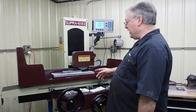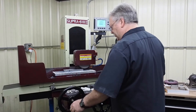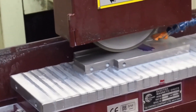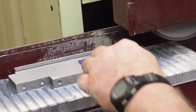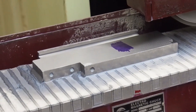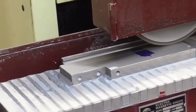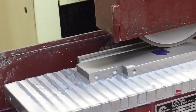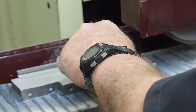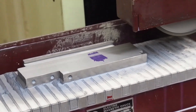I think this will probably be the last pass I do. I think everything's flat on that wheel within one tenth. I'm at the same surface that I cleaned up. I got my ink spot. Looking at that, we got just a little bit on that back end — and if I'm going to have it anywhere, I want it on the back end. But we're actually taking the ink up from there. Winding down one tenth — and that's pretty darn close right there. We got the middle section all the way up to the very back cutting. That's probably about the best I'm going to get with this method.